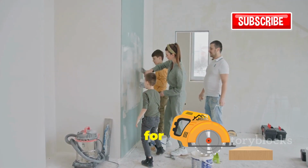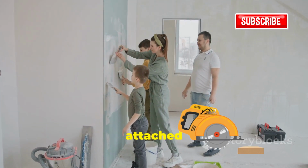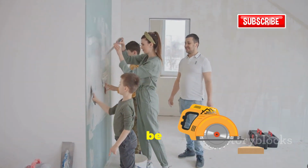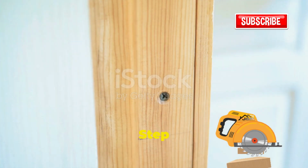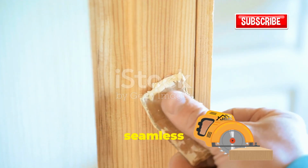Repeat this process for each panel, taking your time to ensure accuracy. Properly attached panels will not only look great but will also be more durable and long-lasting. Step 4. Fill the gaps and sand. Fill the gaps with wood filler, then sand down for a seamless look.